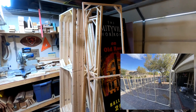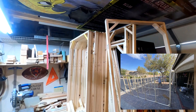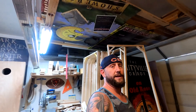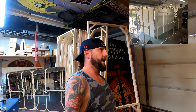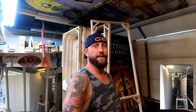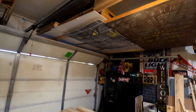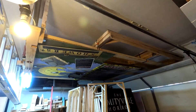You'll see that in some pictures that we'll end up showing. We also do corner supports — those are just brad nailed in. I haven't had any issues; I've been doing this technique for at least a good three years now and find that they're much less expensive than your standard two by three or two by four plywood construction. And because these aren't going to be outside for a long length of time, I'm not really worried about that. Keep these things portable — if you look up top in my garage, that's where all the panels from the previous years are stored.